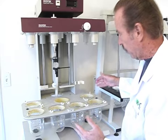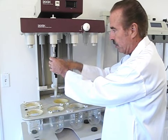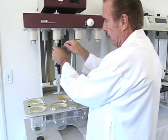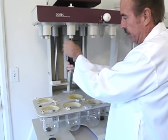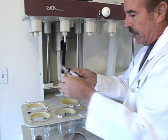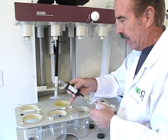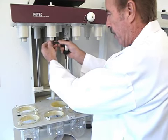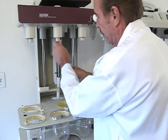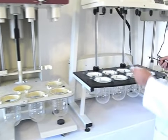Then we'd go around with the rest of the vessels and do the same thing — record those numbers, do the math, record the numbers. By the way, these gauges are all calibrated. They come from the factory originally calibrated, they've got their stickers on them, and they're all certified. There's a certificate of conformance included. Every component in the kit is calibrated and certified. Annually, you can return them to QLA for recalibration.